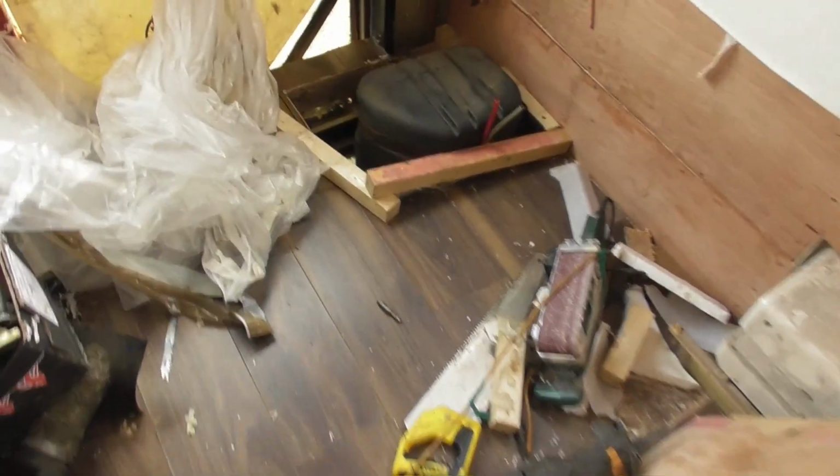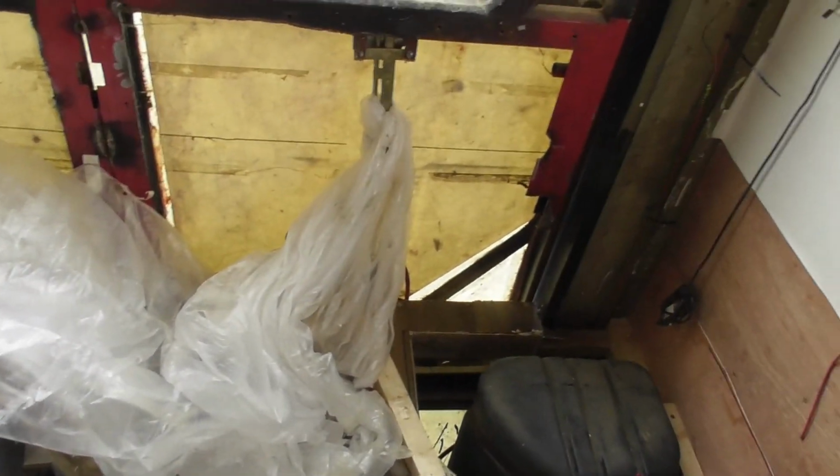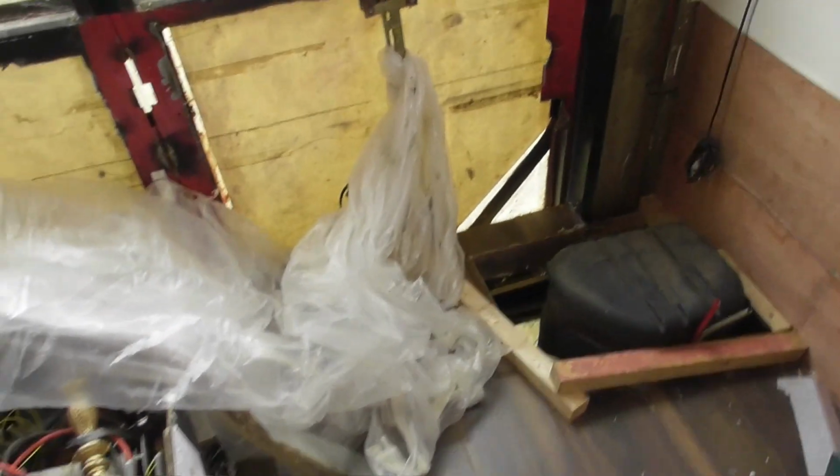I need a tube to run from that tank to the outlet, that side. And obviously the waste pipes that have got to go in the shower and the sink have all got to run at separate heights. I don't have the sump for the shower, don't have the pipes either, and here's the biggest problem. I'll be running the pipework on the sink at a height, and I'll be coming down slowly until I feed into the tank. The problem is, as you can see down there where the doors are, there's no structure whatsoever.